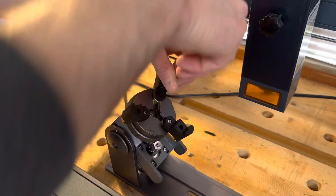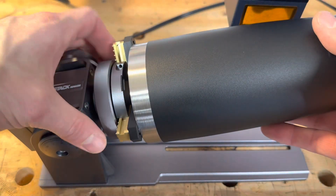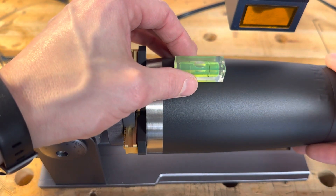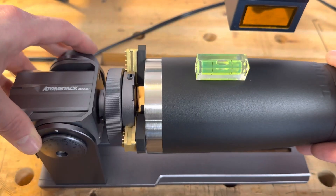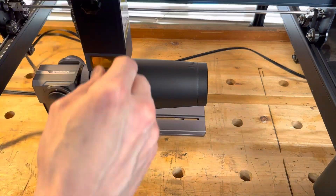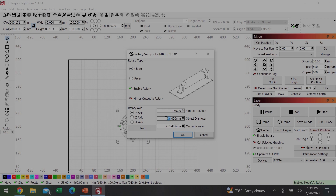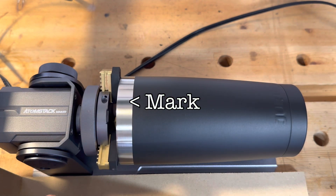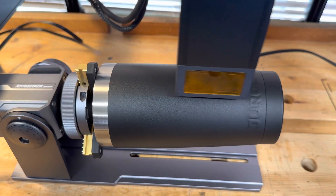I swapped around the chuck jaws to try again with one of the insulated mugs. There are a lot of different ways you can set the chuck jaws — I would recommend trying to have the least amount of profiles sticking up around it, because when they stick up too high it's pretty easy to have the laser bump into them and that screws everything up. Once I got everything aligned and leveled, I reoriented and resized my graphic. In the rotary setup menu I put in the diameter of the mug. It seems that with the Atomstack R1 it's always 160mm per revolution. I carefully checked the framing again before starting my engraving.